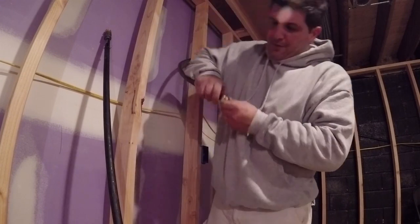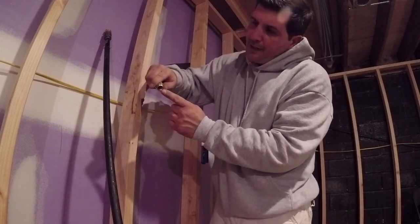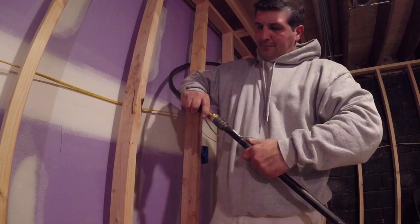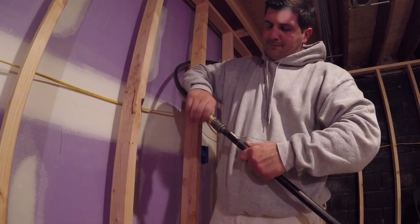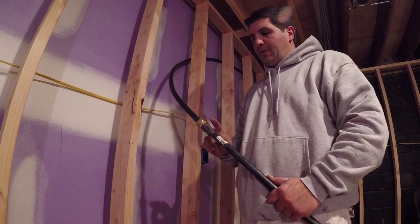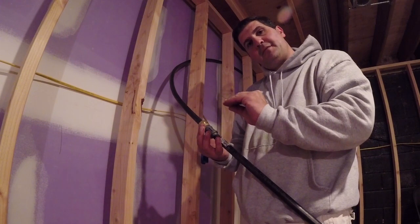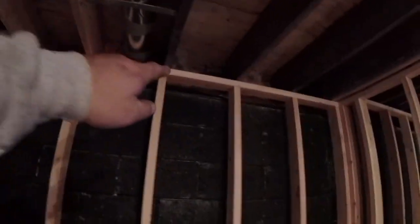Make sure it's sitting right — keep only one corrugation out, because when it clamps down it presses and that's what makes the connection. Now take your pipe and insert it in snugly so it's sitting nice. Take your nut and turn it on. When you're tightening this, make sure the lower piece doesn't move and you're only spinning the top nut, because you don't want that corrugation to spin — you just want it to seat correctly. That's it — this is what the hookup looks like when we're all clamped up.